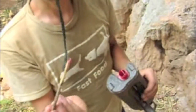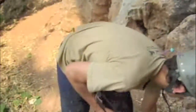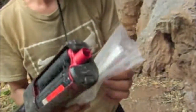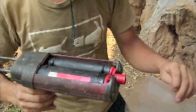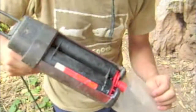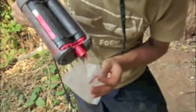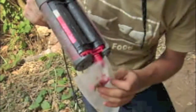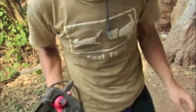And you can see it's two separate colors, and when they mix, the shade changes. So once you've done that, and to keep things tidy, we use the off foil pack bag. You want to pump the gun a few times to make sure that both parts of the resin system are coming out. You should be able to see there's the red and now there's the slightly grayish color, and they're both coming out at the same time. This just ensures that we know both parts of the system are being discharged from the foil pack.